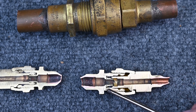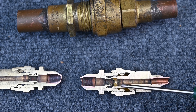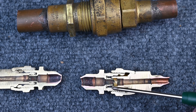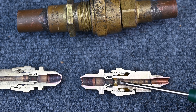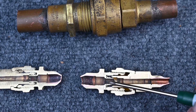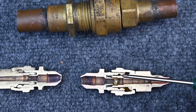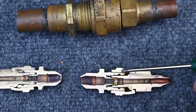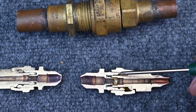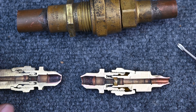Here you can see how the metal is curved back on itself. Originally it was a flat piece of metal, and when these two pieces pushed in, it broke the metal and gave it a place to go — the other side did the same thing, pushing and rolling back the other direction. That's what punctured the refrigerant lines. Right here you can see the groove where the rubber o-ring sits all the way around — that's what helps seal these two pieces together.